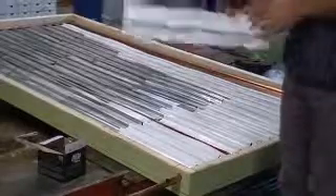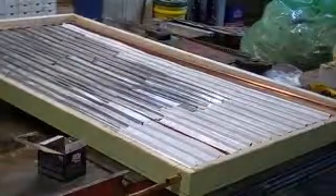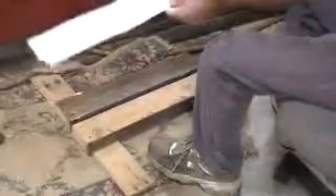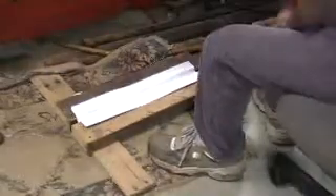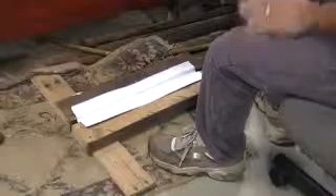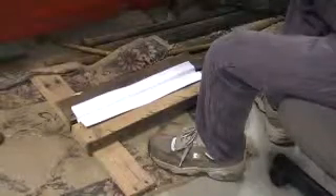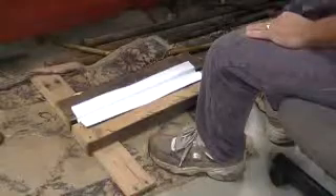You can go to their site — they'll probably do a much better job of explaining it than I'm going to. But you'll just lay a plain piece of this that's not actually bent yet, it's just flat. Cut it to the size you want, lay it on there. You're taking a rod — in my case a piece of rebar, which is probably not the best thing because it leaves little ridges. You really want just a nice flat solid steel bar that's the same size as your riser pipes or whatever you're wrapping it around.